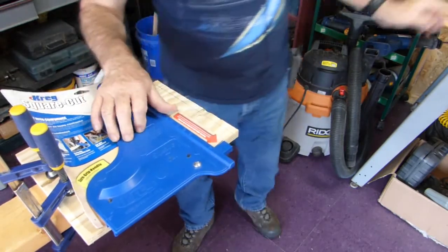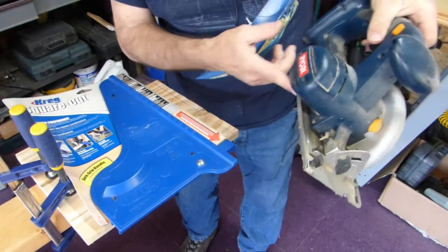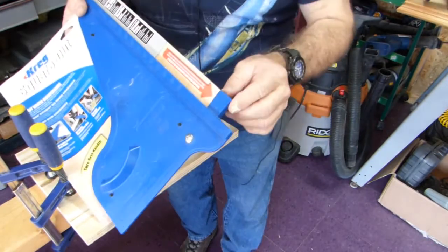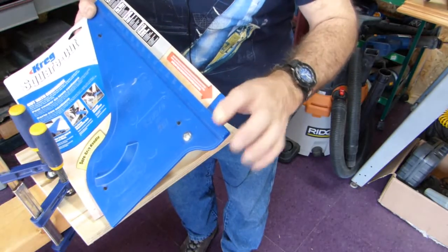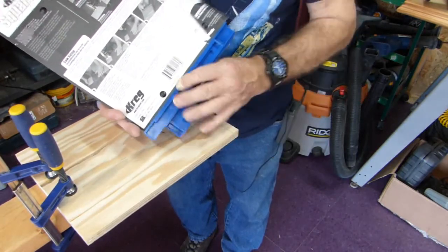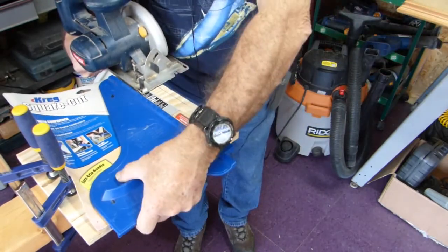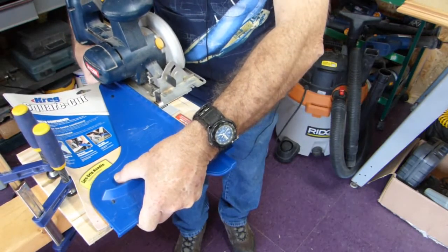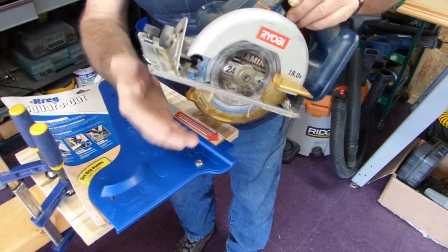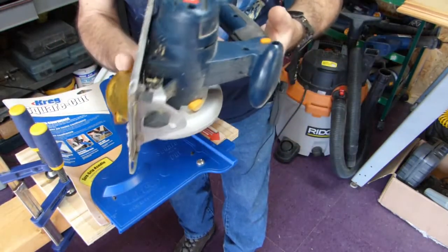There's another problem — we'll bring back the little guy first. You see where this blade is? If I need to cut this way and keep this side of the saw away from it, I've got a problem: the blade will run right into this plastic. This plastic is backed off as far as it will go into the tool — this is as far back as it will go. There's a lock; it stops there. So I cannot use what I just showed you. Not with that saw, because I can't come from this side. For the Ryobi, the DeWalt, or most saws, I'm seeing a problem with this piece of plastic actually being in the way, and because you can't back it any further, you really can't use this saw with this tool.